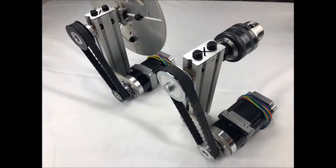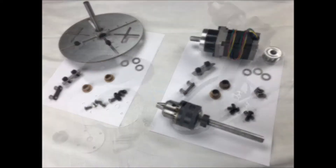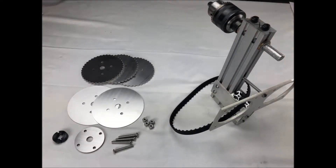Here is the mandrel drive post from the smaller X-Winder and we'll be reusing all these parts, with the 2-axis mandrel parts on the left and the 4-axis parts on the right. Next we're going to mount the mandrel shaft drive gear which includes 3 large gear plates, the thin gear end plates, the small circular swash plate and the 2-screw clamping shaft collar. Make sure you're using the correct shaft collar — it's basically 2 C-shaped clamping parts with 2 screws.